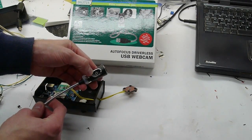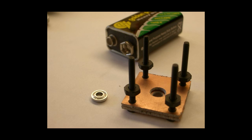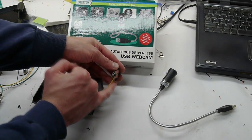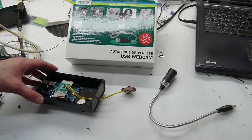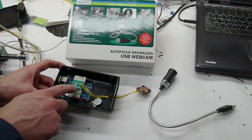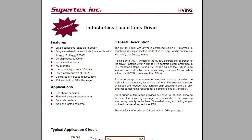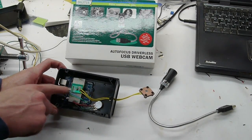This is what the camera looks like — there's the lens. I cracked one of these open, and the lens looks like a little button. I just sandwiched it between these two copper clad boards to make electrical contact with it. Inside here, one of these copper clad boards is one electrode and the other is the other electrode. To drive one of these lenses, you need a fair amount of voltage. The lens is connected directly to this chip, which is a specialized liquid lens driver chip — it's an HV892, made by Supertex. This was also a difficult chip to get, and it's a difficult to solder package. It's a surface mount, and I couldn't find any standard breakout boards for this particular layout, so I actually had to have this breakout board made just to get the pins accessible.